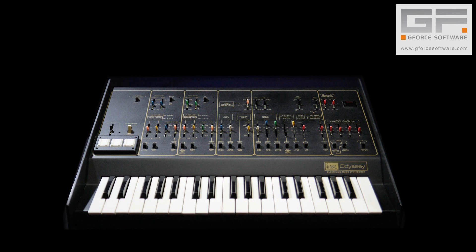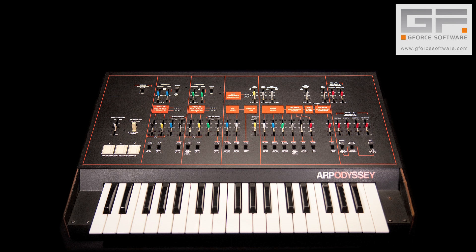Now, as such, many Odyssey aficionados think that the 4035 is the Holy Grail, but conversely, many think the sound of a real Odyssey is the subsequent 4075 version. However, there's a complication in that due to an error, the 4075 doesn't open up as high as the 4035 — not unless you do a little hardware modification, that is.